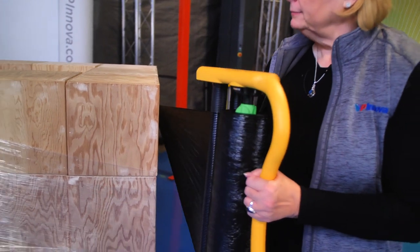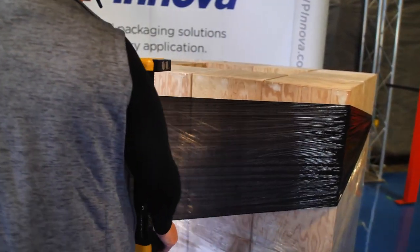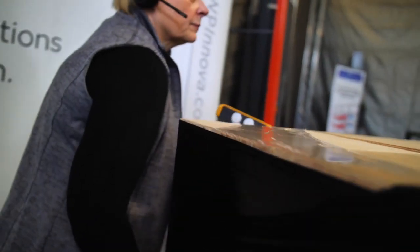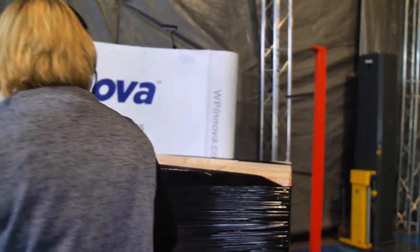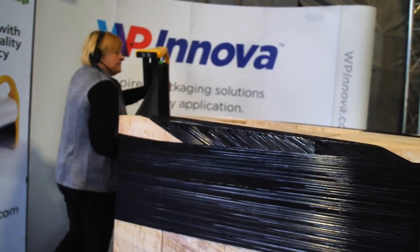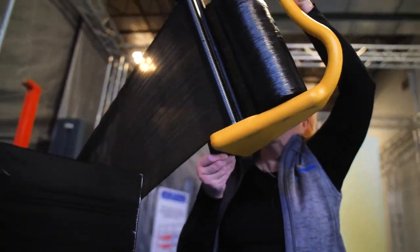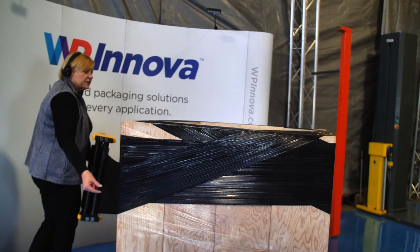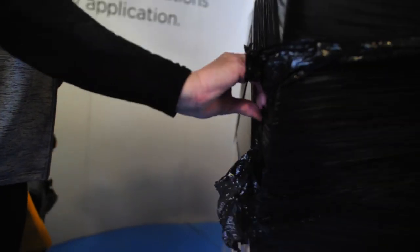You come around your pallet. When you're halfway, your hand is in the middle of the dispenser — halfway — you're going to lift the dispenser, come up and over the corner. You come around and you grab the alternate corner. We repeat the process containing the other two corners as effectively: up and over and down, halfway, up and over and down. Coming across around the corner to finish the pallet like we normally do, pinching the film and pulling the dispenser away and patting down the film.